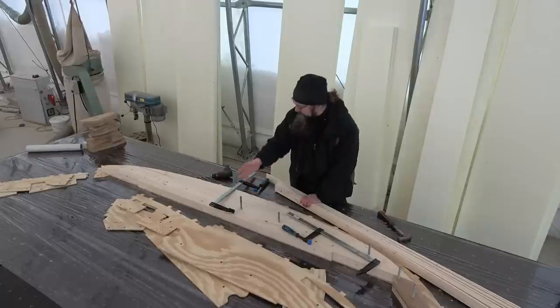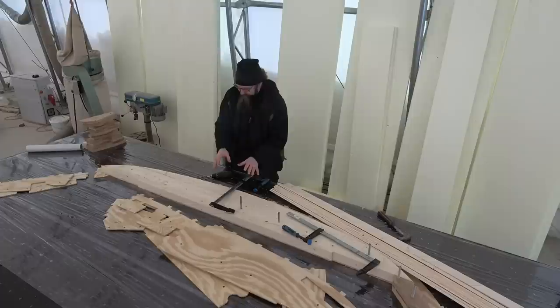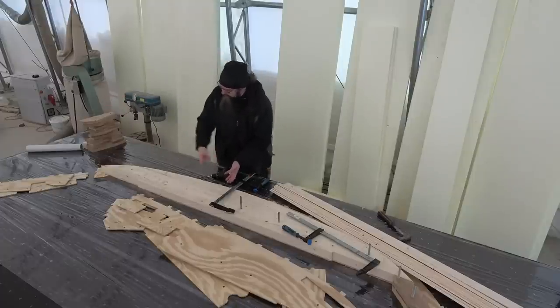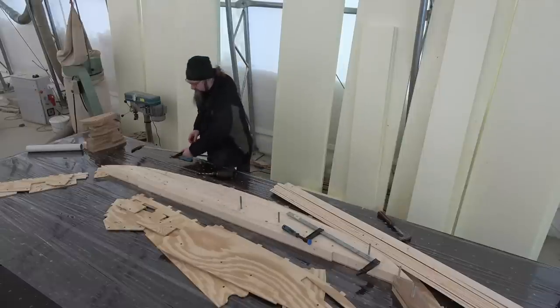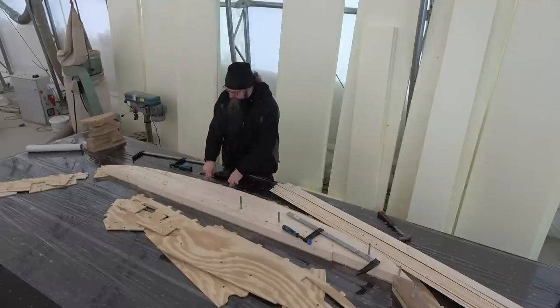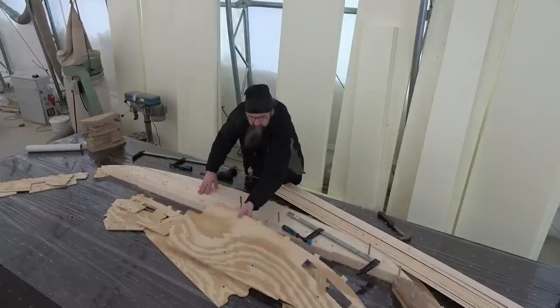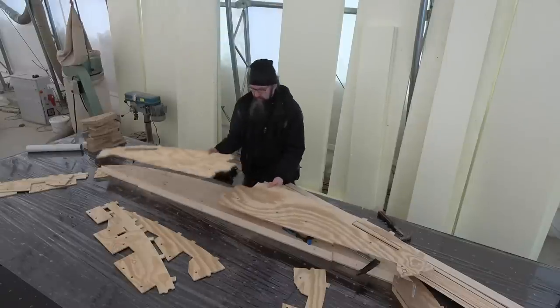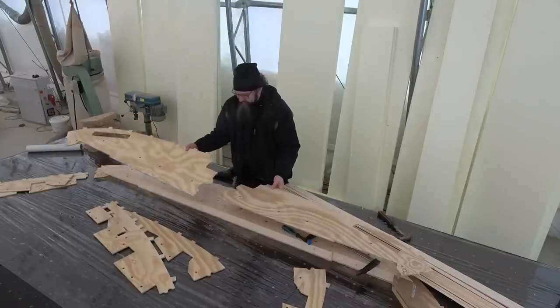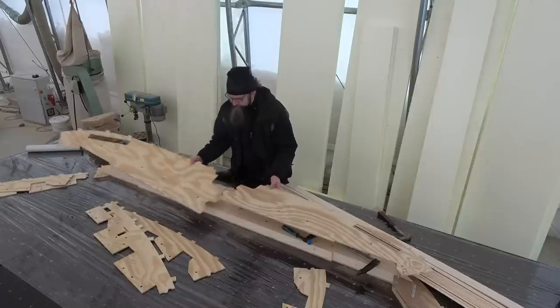The problem, however, is that I don't want to spread the glue on this side just yet because there's going to be another frame half in here and I need to have a fresh wooden surface to glue it on this side. So I need to figure out how I'm gonna prevent the epoxy going on this side of the plywood and on top of this side, because these floor pieces are made from 2 pieces of plywood, like so. So this one I don't want to glue just yet because it will go above the next frame half, of course.